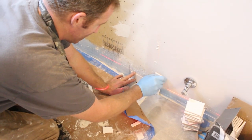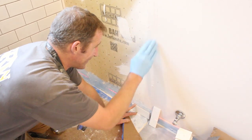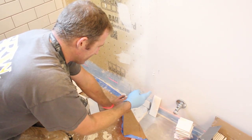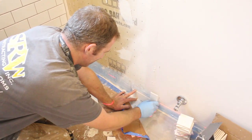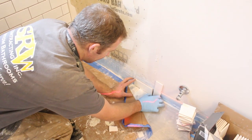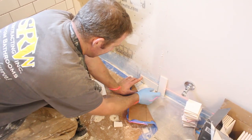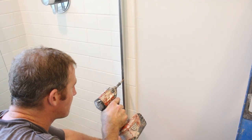The main reason I want to do that is: my waterproofing ends at the end of my shower, so I have all this stuff that I don't want to have to sand down or try to fix. Some of the sealant's sticking out here, and the backer board's ending at the end of my shower. So it's always kind of nice to bring the bullnose or the edge of your tile a couple inches outside of the shower. And not only that, but my shower doors are going to be sitting directly on the middle of this transition, so it's nice to have a couple inches outside of that for the channel that the fixed panel goes into.